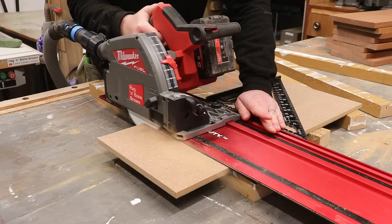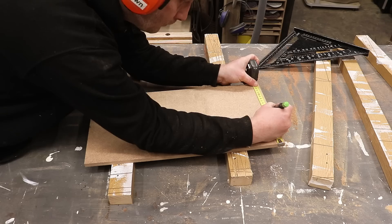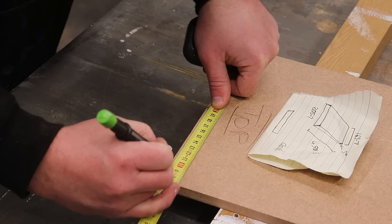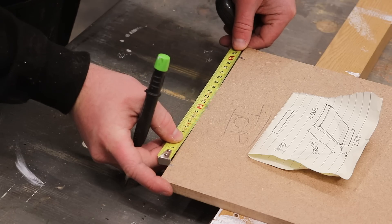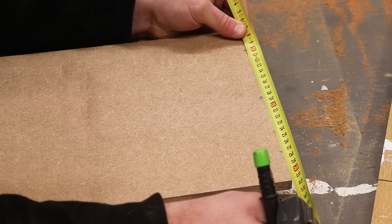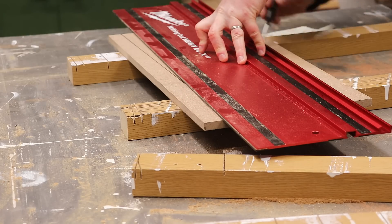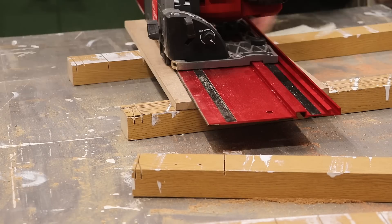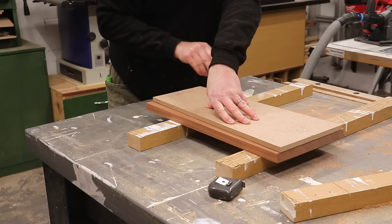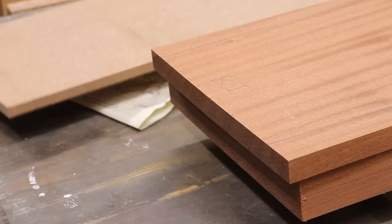The blade in my saw is now tilted back to zero. I cut that to the same length as my sapele boards and then mark up the center point at the top and bottom, carefully marking out the dimensions based on my drawing as accurately as possible measuring from those center points outwards. I can then join the marks with a line to cut to and make those cuts to complete the template. Then I can simply draw around that template onto each board, making sure that the bottom of the template is placed on top of the bottom inside face of each board.